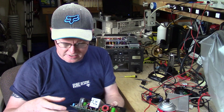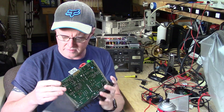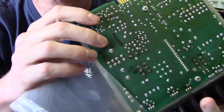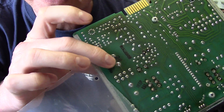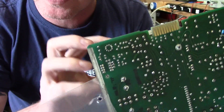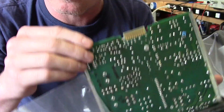I'll make sure they'll fit in the case. The big important things are the diameter and height of the cap itself. I'm looking at the spacing on these leads — that's what's going to be most important so that when I get replacement capacitors they actually fit and work.